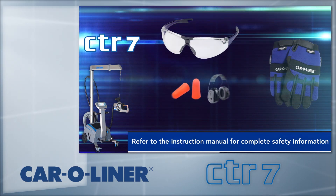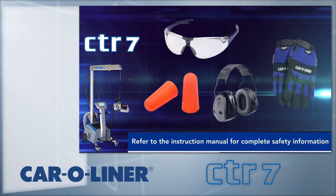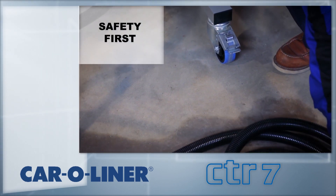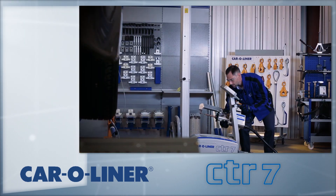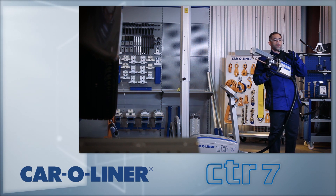As in any repair situation, please ensure your safety before preparing to weld. Welders must be used away from moisture or chemicals. Be aware of the potential trip hazard created by cords and welding cables. Vehicles need to be fully protected before welding, including isolating the electrical system. Be aware of the weight of the C-gun and arms.